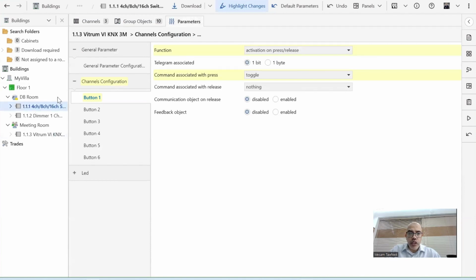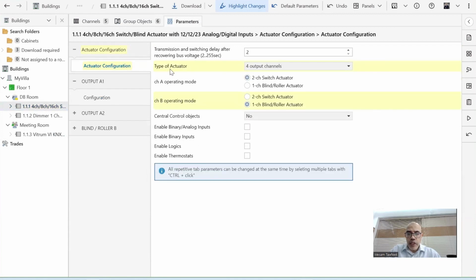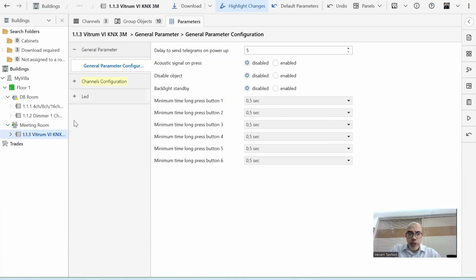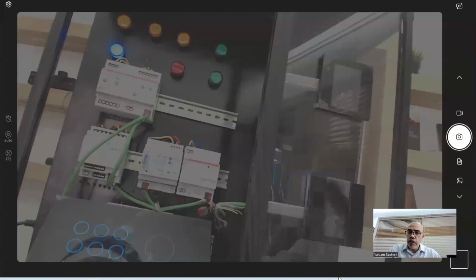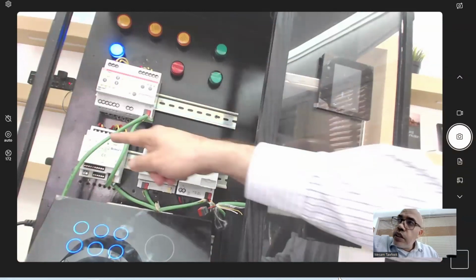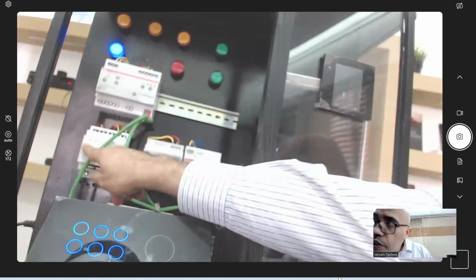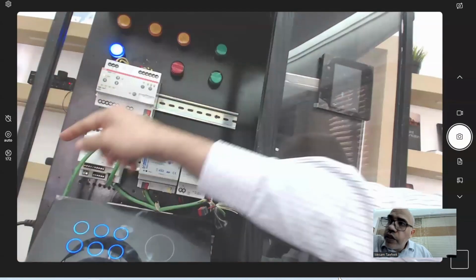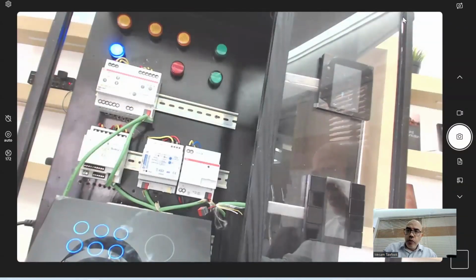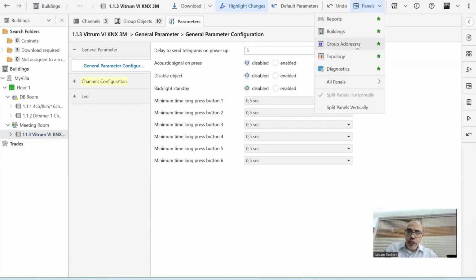And also I have my channel 1, output A1 in my relay, in my multi-channel actuator acting as a relay. So I need that when I press this button, I send a command on 1 or 0 to this channel, which is connected to this lamp, which is there. So I need to do this via the keypad. So I need to combine them together, the keypad and the channel actuator, the output A1, in something we call a group address. Okay, so I come here, go to panels, and I choose group address.